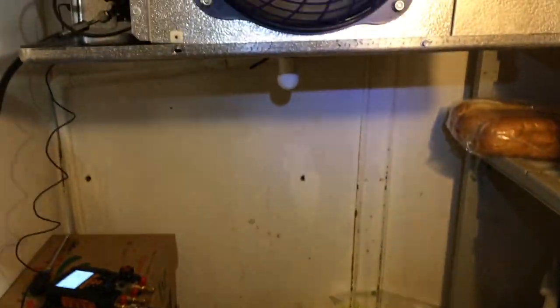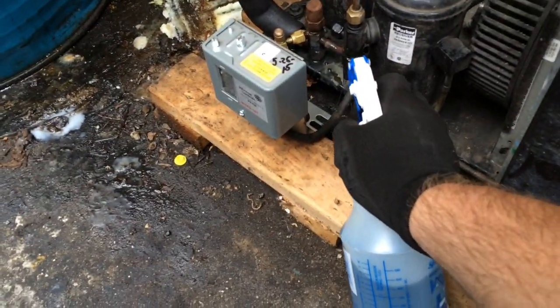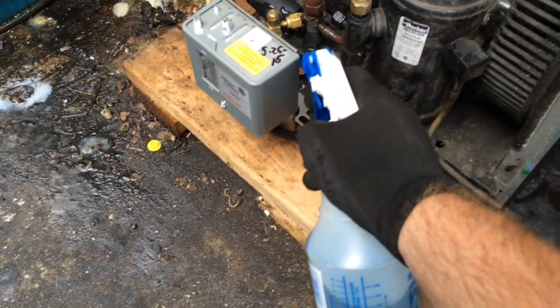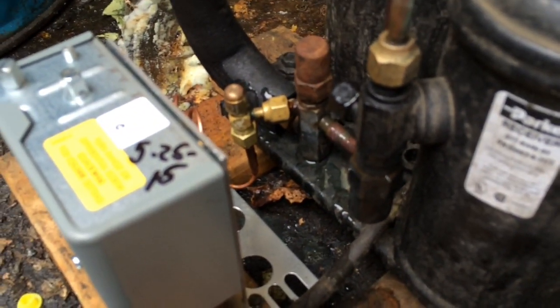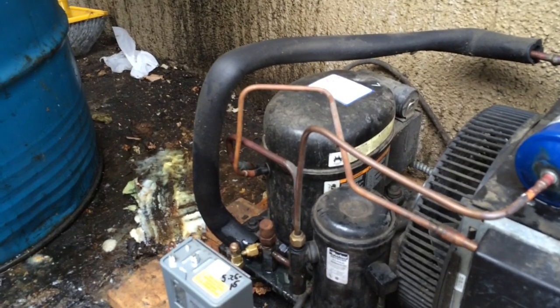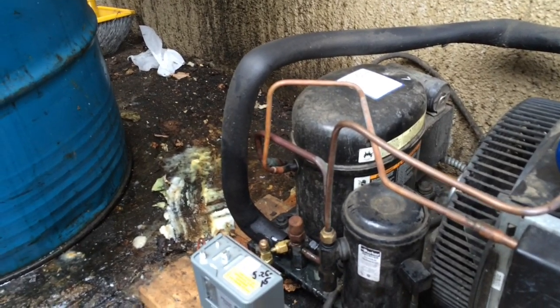So we'll let this pull down. The last thing I like to do after I've got everything checked is turn the unit off and check my last two connections under system pressure — that cap on the king valve and the cap on the T. If we're all good, then we're good to rock and roll. All right, thanks for watching. I'm going to go check out a walk-in box next, and I think I got an ice maker call. Oh, and I just picked up another fridge call, like a makeup table. Gonna be a busy little day today.